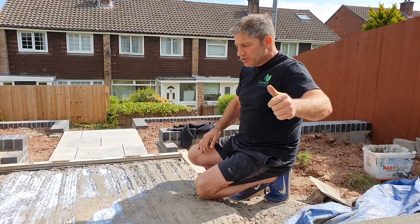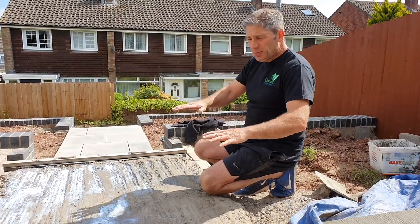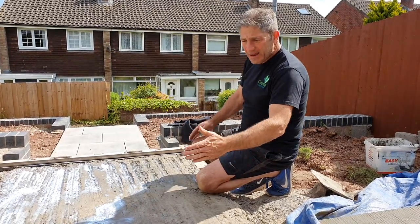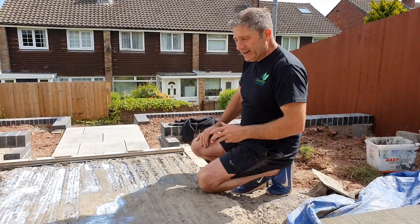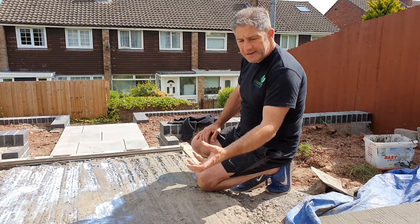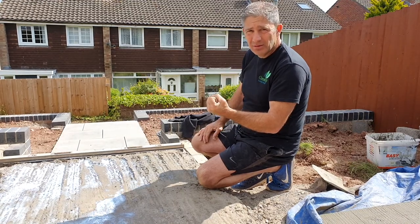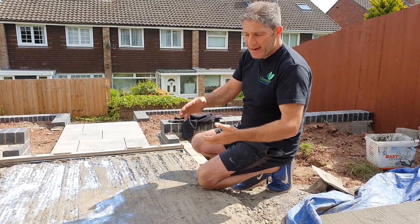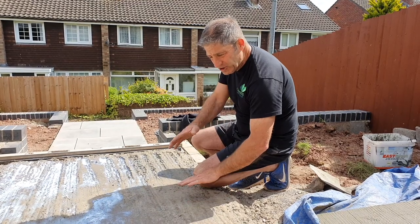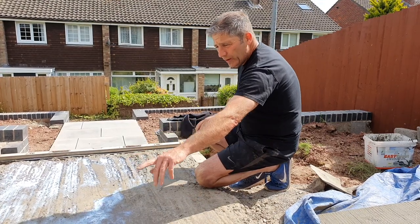There's a client watching at the moment. What we've had to do here is make this path section stable - it's not just about putting MOT Type 1 down because that wouldn't be enough. We've concreted a padstone here for this path coming up. The important thing is you don't want the concrete sucking the water out of the mortar that we're laying the slab on, because it'll delaminate and you'll get hydrostatic pressure working along the slab, and eventually the bedding mortar and slab will delaminate.